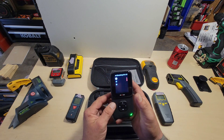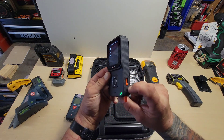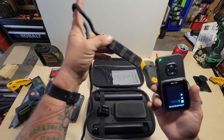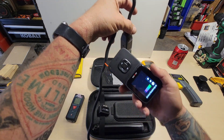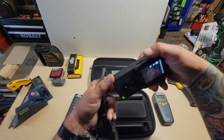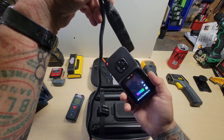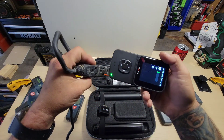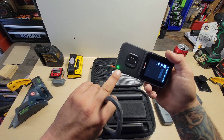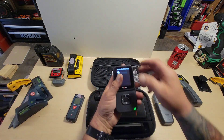There's a tick tracer or AC scanner on the side. Push this little nub and a probe comes out. With a hot extension cord, you can see on the screen there's high, medium, and low sensitivity. On high, as it touches the cord it shows on screen, and also in the receptacle slots. It also has a flashing light — green normally, red when it's hot.